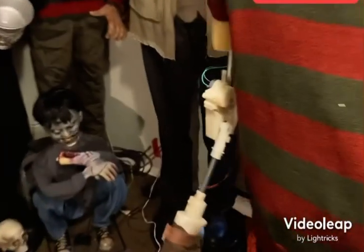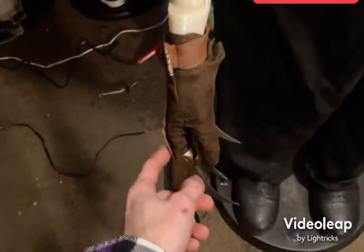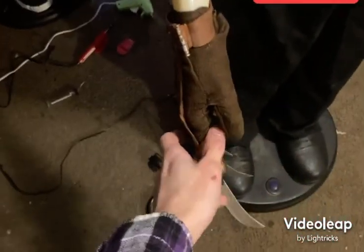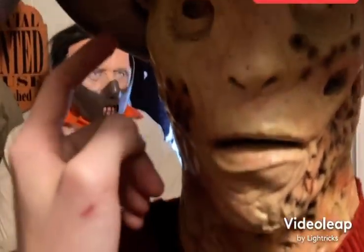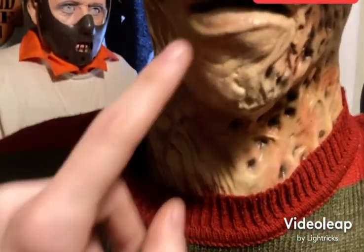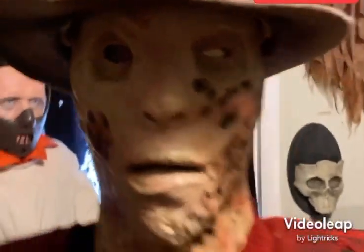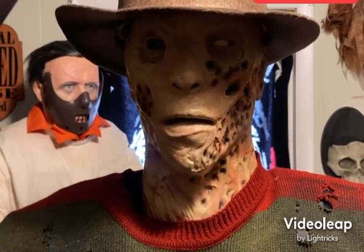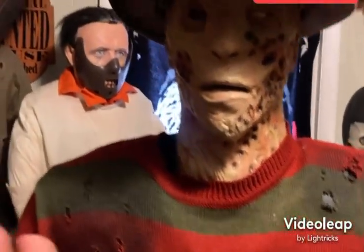Right now the arm does move up and down, but the fingers do not currently move even though they are wired up — so it could be a split gear, a dead motor, or a wiring issue. The arm works, the mouth works, and the eyes work. I just got done wiring the mouth motor and eye motor because they were completely ripped off, and they do work. I just have to finish gluing the latex back onto the mouth. The eyes do have a split gear but they're still moving, so I can get a few more years of use out of that.